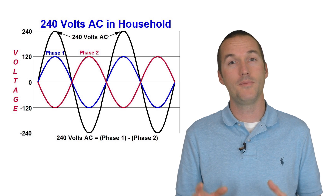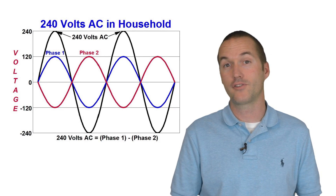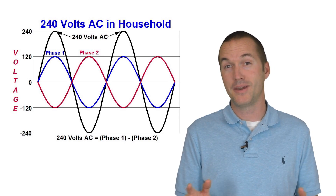Also in the US, any time you combine multiple switches into one, you need to make sure that the wires in your electrical box all come from a single phase. Mixing up circuits from different electrical phases is a major no-no.